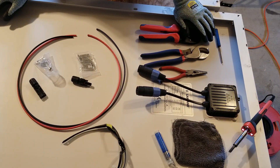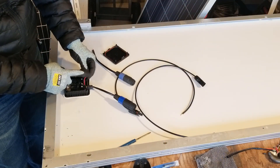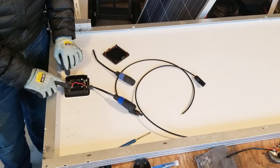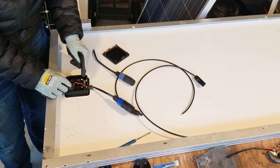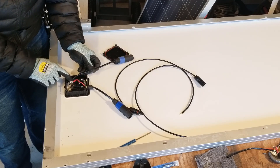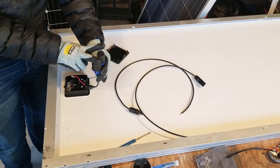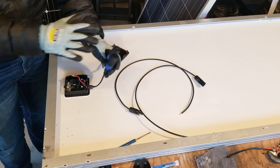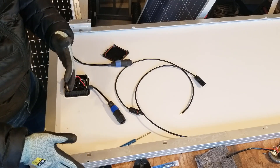The way it actually works with each connector, they have a positive and a negative wired onto each of the posts. This is the positive and this is the negative. They bring in a positive and negative here and then a positive and negative here, which makes it so when these connect together it's still a positive-negative connection all the way through — a parallel connection.